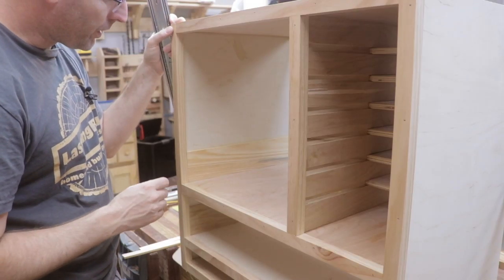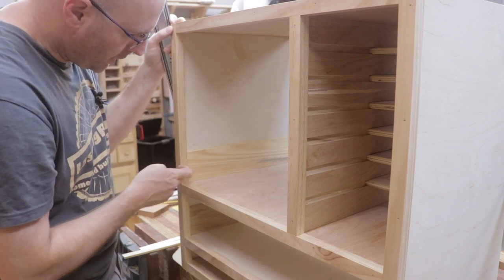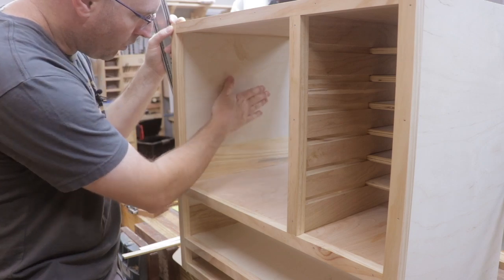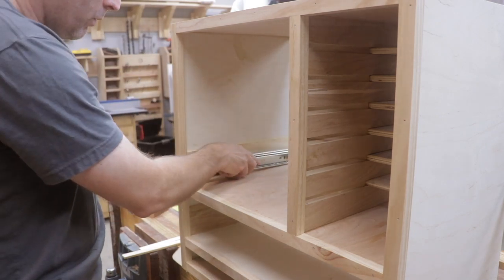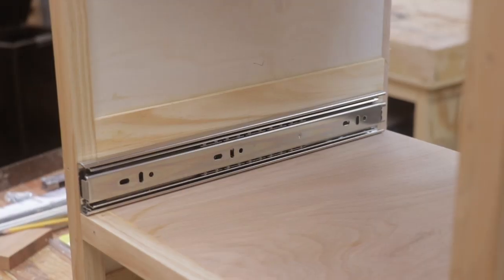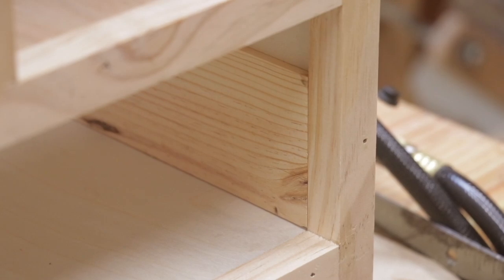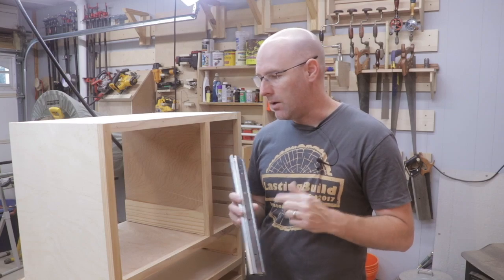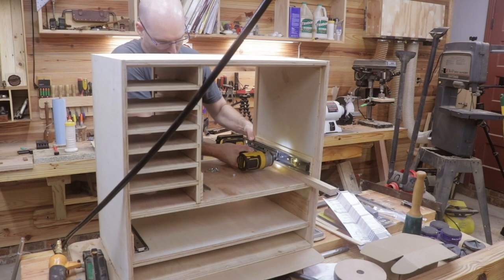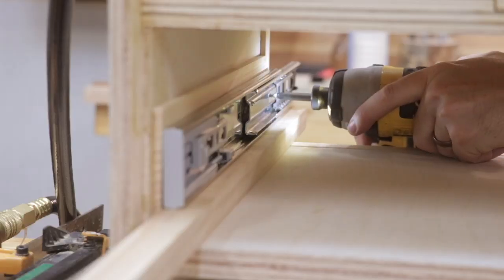We're making really good progress. I took a little bit of pallet wood, planed it down, and glued it in position to make the walls of the cabinet flush with the trim on the front side. That way when I put my drawer runners in, they'll be flush with the trim and the sidewall and I won't need any shims. Now I'm ready to put in my drawer runners — I'll attach those to the cabinet, take measurements, and then mill up the pieces for the drawers.